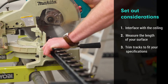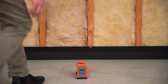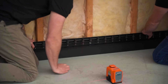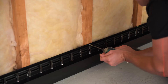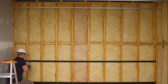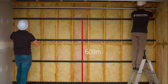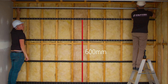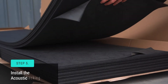This is the simplest method, but remember to consider whether your application needs each end to start with a batten or a gap. You may need to trim tracks to fit your specifications. Step four is to install the tracks. Fit the first track using a string line or laser line, then complete the same process for the rest of the tracks ensuring the clips of each track are aligned. Before attaching each track, notch the end to fit above the edge angle. Continue attaching the remaining tracks at the required spacings for your batten material, making sure the batten cantilever does not exceed the recommended limit of 150mm. The track should be spaced according to the specific project engineering requirements — typically 600mm for timber battens and 1200mm for aluminium in interior applications.